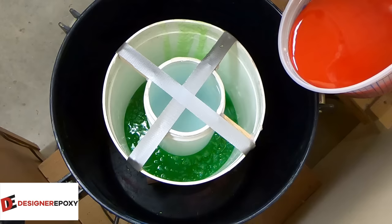And again, beautiful, beautiful burl. Can't go wrong with maple burl. Awesome resin too. Okay, so what do you think about our shape so far? I want to go a little more like this. This casting, as far as I can tell, only has one small little bubble in it right there, but it's right on the high point of this. Ordinarily I would turn that away, but what we're going to use is just a little bit of UV epoxy from Designer Epoxy to fill this in, or UV resin, sorry.